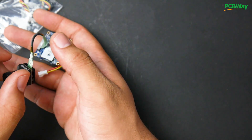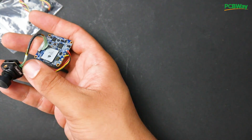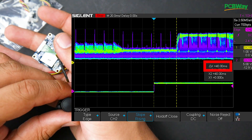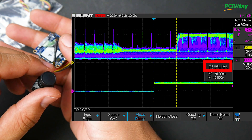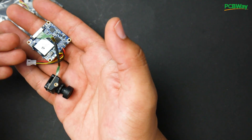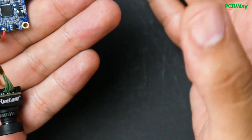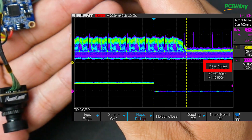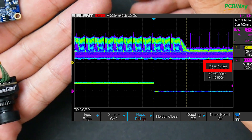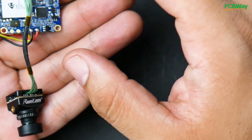This is possibly the fastest 4K latency camera — the Caddx Loris we tested was around 38 to 47 milliseconds, while this one comes in at 33 to 40 milliseconds of latency. So 33ms and below would be somewhat acceptable, but this camera is not for racing — it's best for casual freestyle where you really want nice footage. Latency is pretty consistent between 33 and 40ms with LEDs on, but when you turn off the LEDs, it creeps up to around 50ms as wide dynamic range and brightness kick in. The LED-on measurement is probably more realistic.